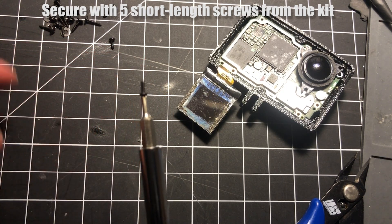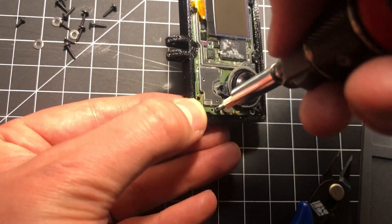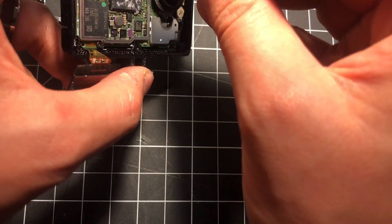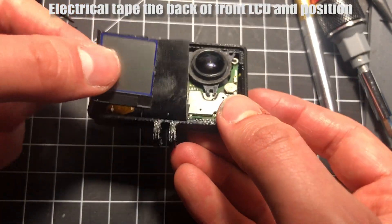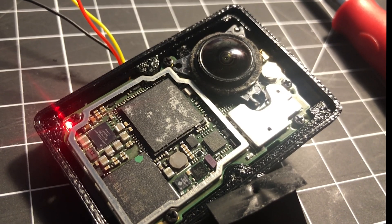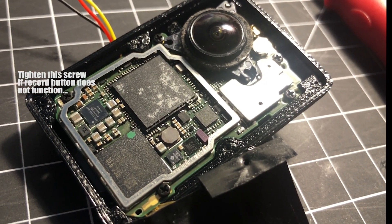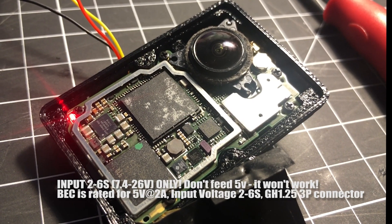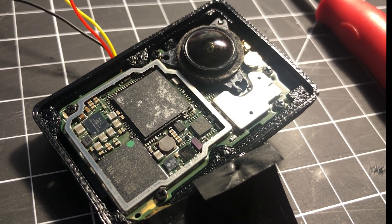Take the short length screws from the kit — there are five of them. Note that I'm only screwing in the logic board here; the lens will be screwed down later to the 3D printed case. Next, apply some electrical tape to the back of the front LCD because it is metal and you don't want it to touch and short anything out. Now would be a great time to plug it into a power source and give it a test. Do you see an image from the lens? Do the buttons work? In my case, the record button didn't work and I had to tighten the screw in the upper left-hand corner to get that connector to snap into place again — it must have gotten loose during the seating process.